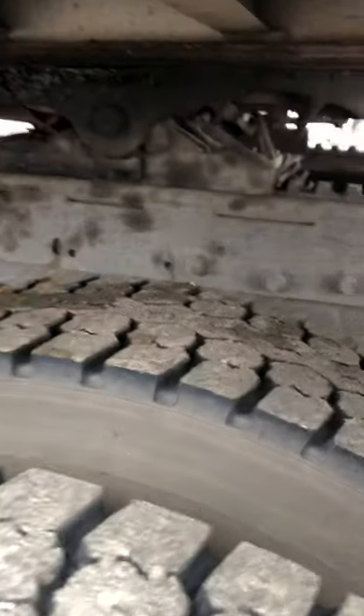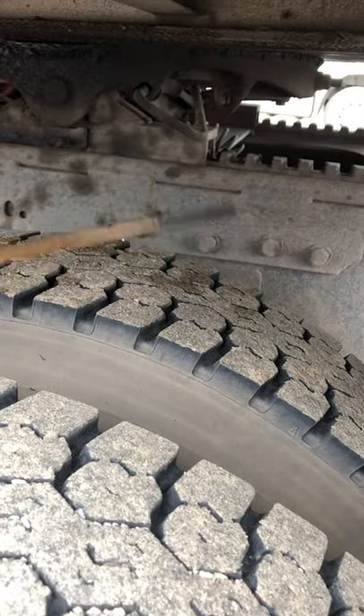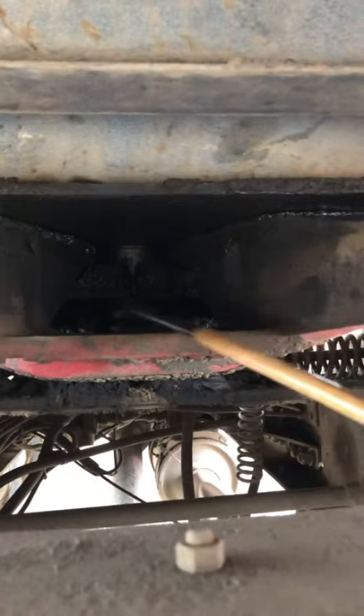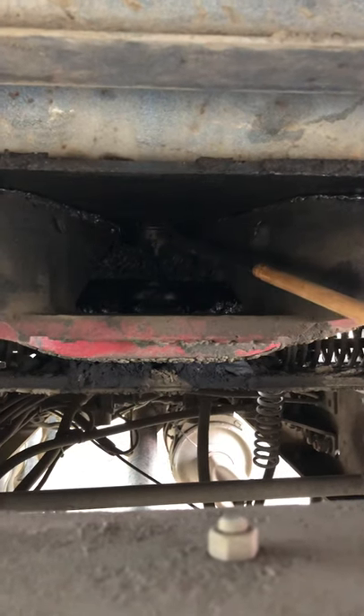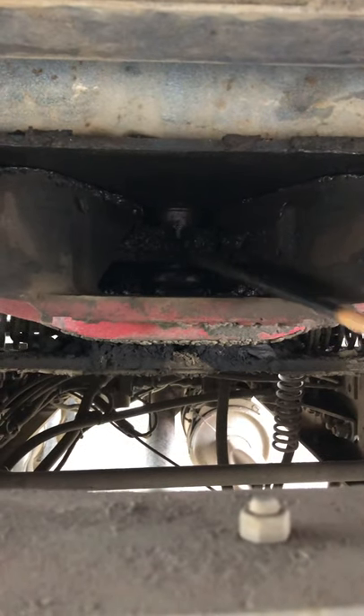Then we check our platform. It should be properly mounted and secured to the frame with no missing bolts, no cracks, bends, or illegal welds. Inside of the fifth wheel, we have two parts: a kingpin in the middle and two locking jaws. We want to make sure the kingpin is always straight with no cracks, bends, or illegal welds, and secured with the locking jaws. The locking jaws should always be in the locking position — not cracked or bent, no illegal welds, and always greased.